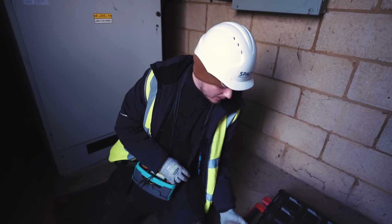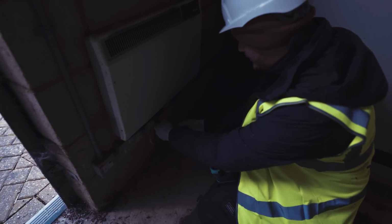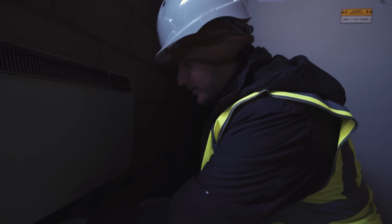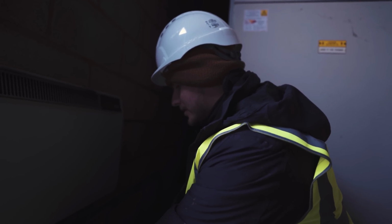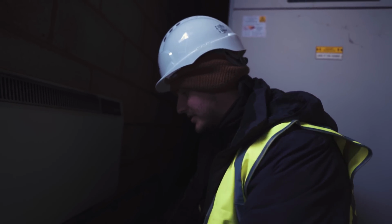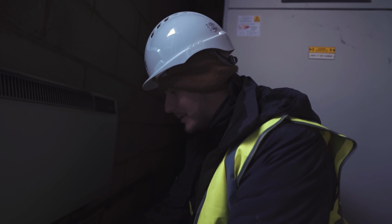but it's the last circuit we need to do. There are 2 more circuits which are brick lights, and they're fed from the car park underneath the building, and then they run around the perimeter. I think the lights themselves are staying because they're in the brickwork, and then we'll just pull a new feed to them. So we just want to validate what's left. Again, I won't show you that because it's just more of the same testing, so it's pretty boring.